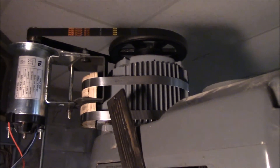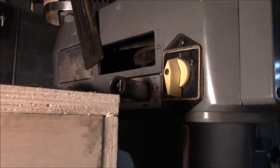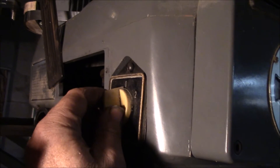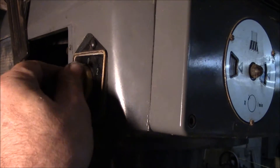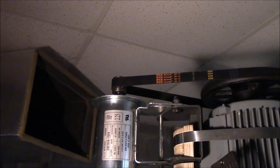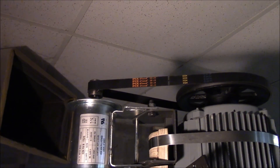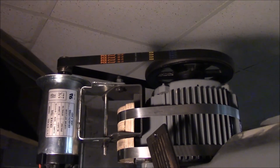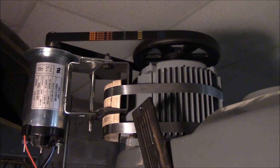I got my mill back. I'll be able to do everything that I want to do. The next thing, I'm going to hook this up so that I can reverse switch it. In order to do that, since that's a screw-on pulley — the small one — I put two set screws in it so it'll run the other way also without coming off. There you go.